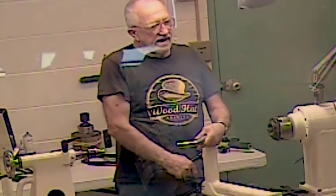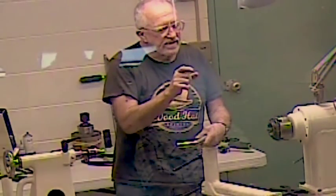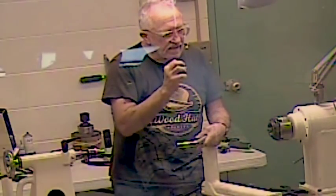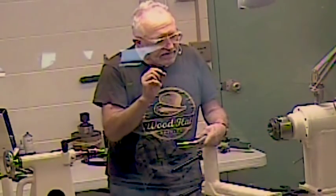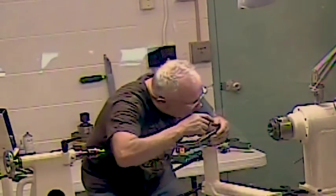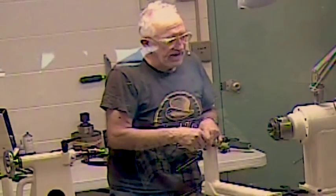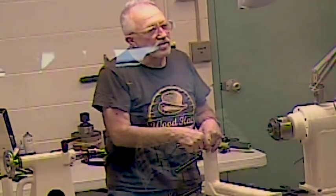And then there's micro hats that are 2.5, 2 3/8 on the brim. They fit my thumb. They're 15 thousandths of an inch thick. That's 2 thousandths less than a 64th. You turn them at like 3,000 RPM. You wear two pair of glasses because you're this close to it. They weigh 2 grams. They are a real, real, real tour de force.